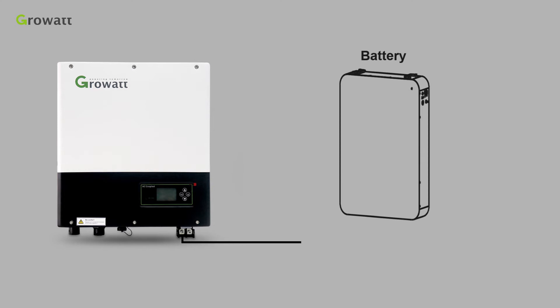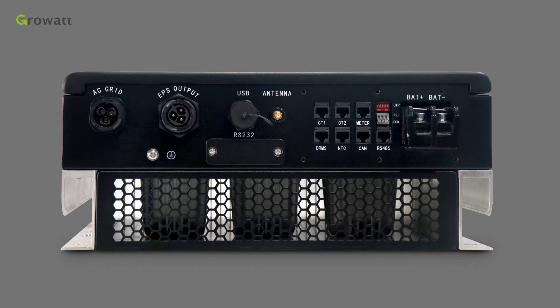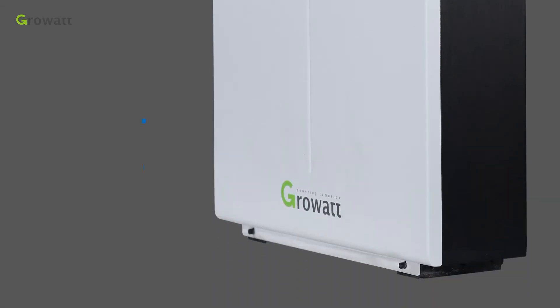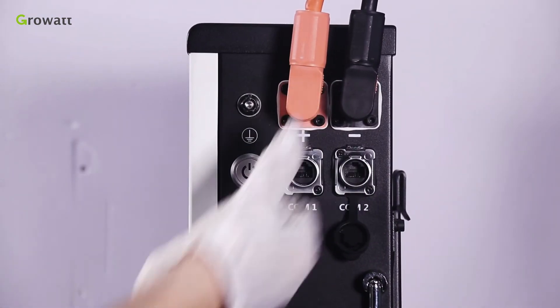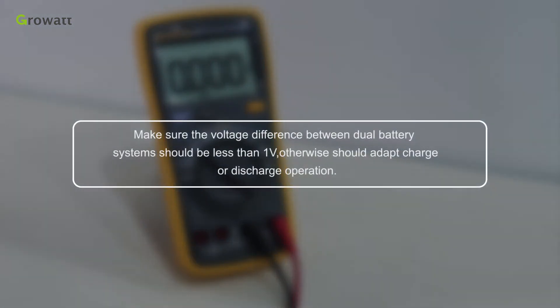When making the battery terminal connection, the suggested distance between the battery and SPA series is no longer than 1.5 meters, and the power line area must be larger than 6 AWG. SPA has series communication terminals. In this video, we choose ATL6531PAC to store power — it has plug-and-play function, so the connection with the battery is simple. Insert the positive and negative power lines and the communication line into the battery ports. Note: measure pack voltage with a multimeter. In a dual battery system, if the voltage difference is more than 1 volt, adjust it to less than 1 volt by charging the pack with lower voltage or discharging the pack with higher voltage before conducting the parallel connection installation. The battery has a one-button shutdown function.